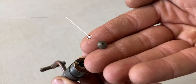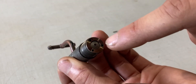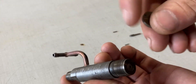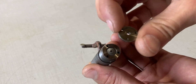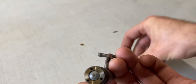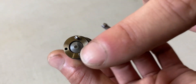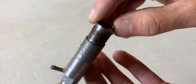The next thing I'll be installing is the spring, which goes down in there just like that. The next part is the spring retainer — this piece will be installed just like this. This will center the spring properly and give it the proper tension. You also want to make sure that piece is in good condition and that the tip is not worn — if the tip is worn you'll have to add more shims. Now our retainer plate has two sides — one side has a little bit of wear from the spring retainer, so I'll put it back just like that. Before I put this back together I'll grab the two index pins and insert them into the two bigger bores. Our fuel will be coming out of this tiny hole right here, and these two index pins allow me to locate this separator plate.